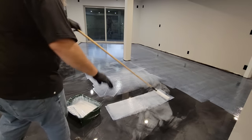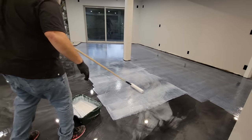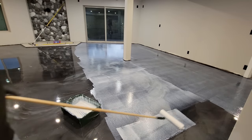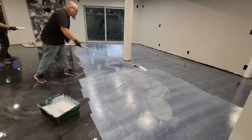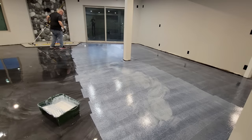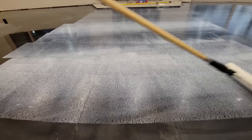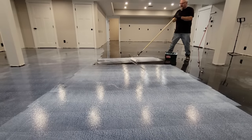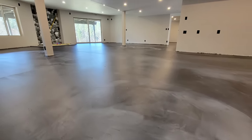When applying my flooring top coat, I'm simply adding it thick and then I'll come back and back roll it to get the material a little bit thin but still have even full coverage over the entire floor. You don't want to leave any undone spots because then you'll see some shininess pushing through and you'll see some lap lines. Do your strokes overlapping themselves using a quarter-inch, nine-inch roller. I went ahead and used some tape to get rid of any loose fibers off that roller prior to applying my top coat.